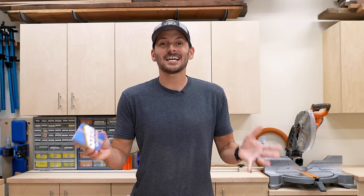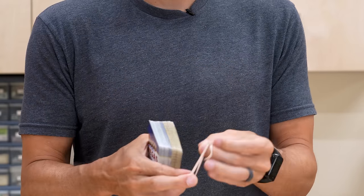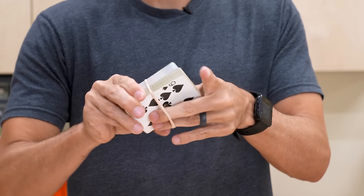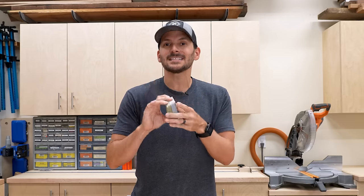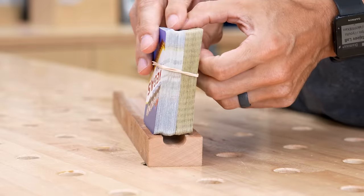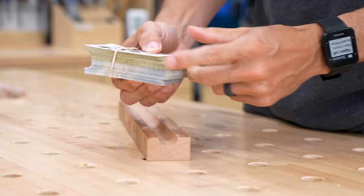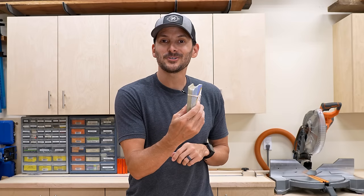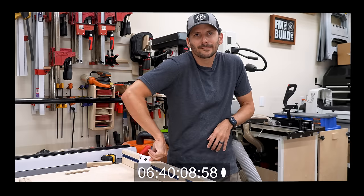It's not perfect but it's way better than trying to do it by hand. As CJ showed, you can also use this as a contour gauge — turn it around and use the short end because it's a little easier, and it won't flex left and right. Press it right into the contour of a groove and you have a perfect representation of the profile right there in the cards. Everybody loves a good card trick — just not this one with a hole in it.